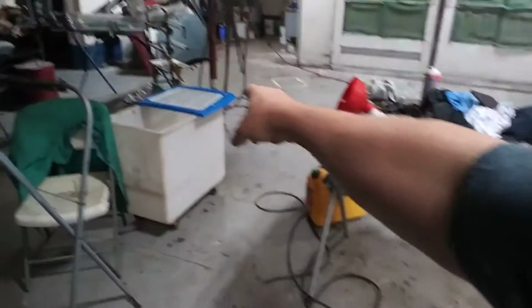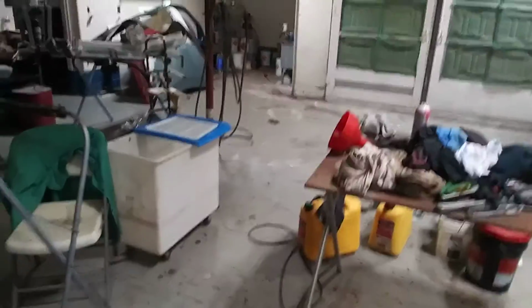It's a Harbor Freight gun, and it's doing a really nice job for me. I just have to be a little more careful about cleaning it. When I first dumped the yellow paint in it, I got a little light blue geyser. The last paint I painted was on those tractor parts, and apparently I didn't get down in the hole. Oil-based paints aren't as affected by lacquer thinner, at least this isn't, as you would think.